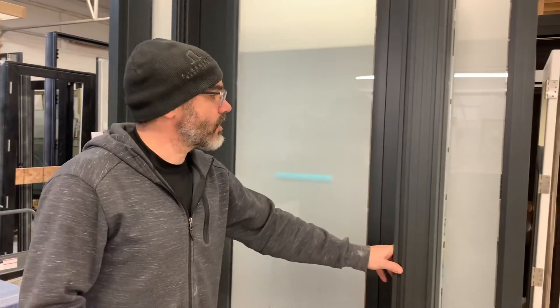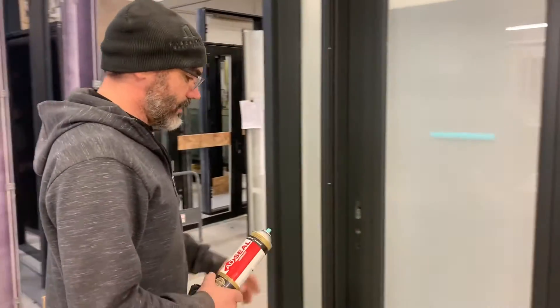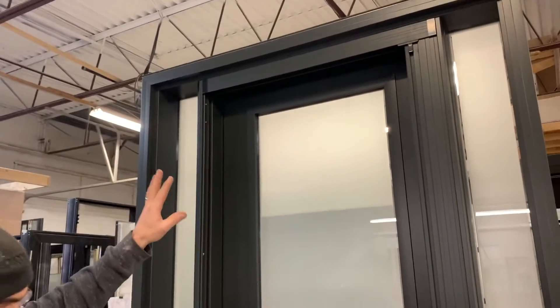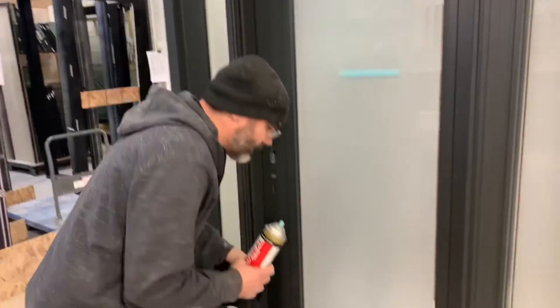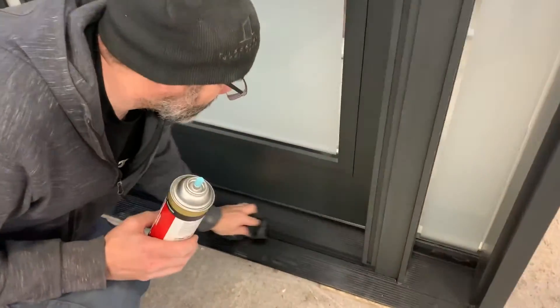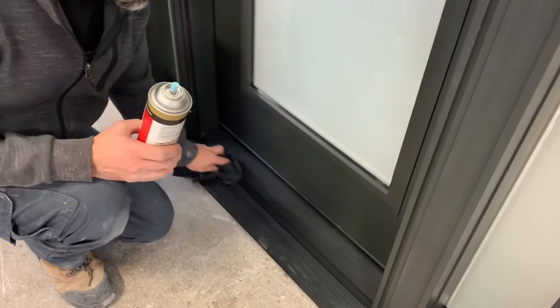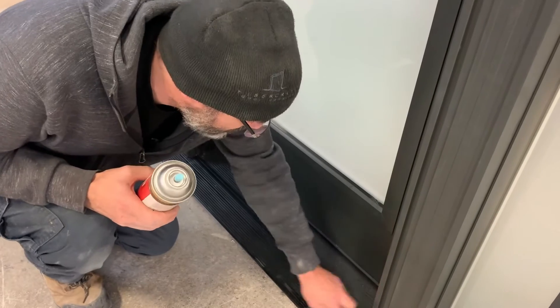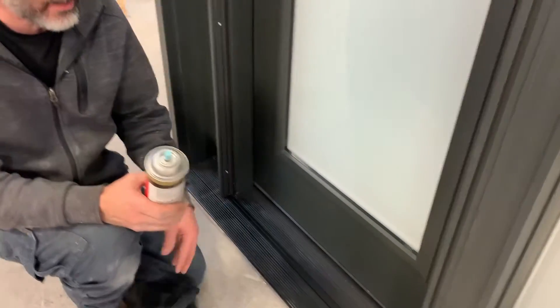Here's the door we have that Vista Screen on. We're going to apply some silicone to the sill track and the top track. What you're going to want to do is clean the track just a little bit first. If it's definitely dirty, getting rid of the dirt is going to be one of the easiest, biggest things you can do to help make things slide better.